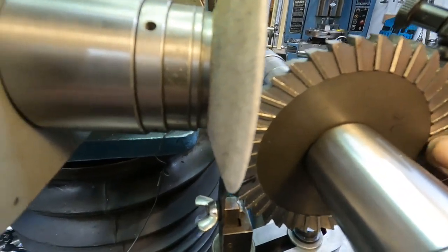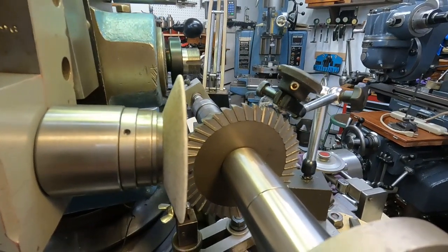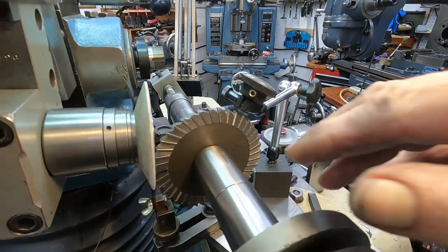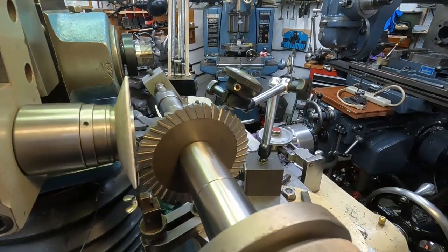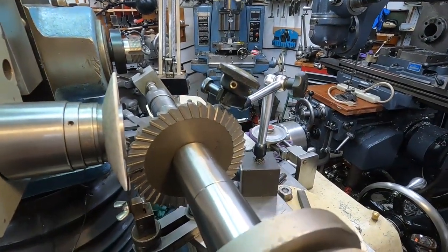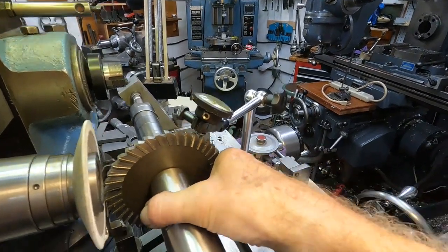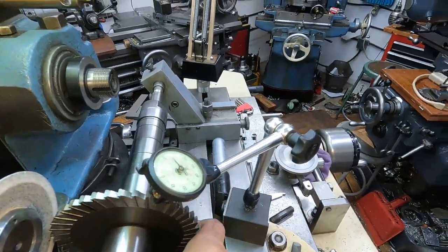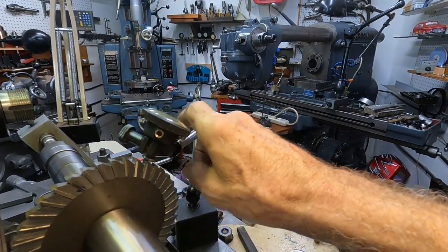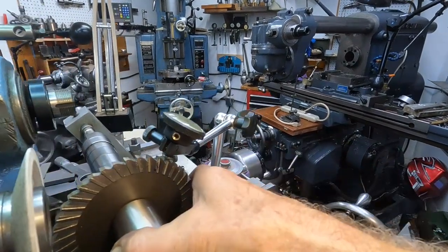You can see the clearances are pretty close. See the finger down there? Now I have this wheel — I'm going to come grind from this side here. I'm going to feed the wheel in, bring it over, and it will grind this tooth right there. It will be sticking out just far enough to get ground and won't touch the one above it. I went and found the teeth that are the highest with the indicator. It's got a button on the bottom — one of those wide buttons — and you can feed teeth over it. I figured out where I'm going to start on the highest teeth.